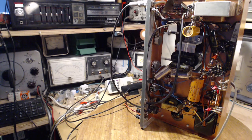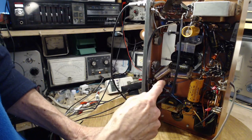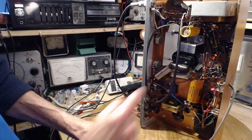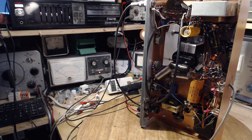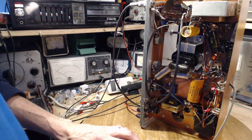That's true. How can we figure that out? How do we know for sure it's that thing? One way would be to replace it and move on. That's not a bad idea. It's very easy to simply take one wire off there. Oh look, there's a terminal right up here. I could just put a diode from the back terminal to the front terminal and cut the lead wire there. Very easy to do. If I cut that wire, we can also test that rectifier. Cut that wire.